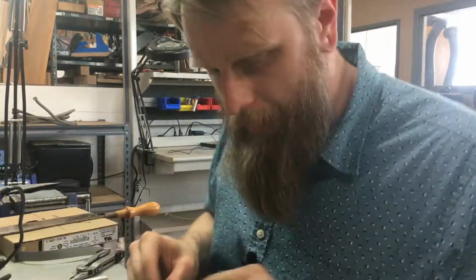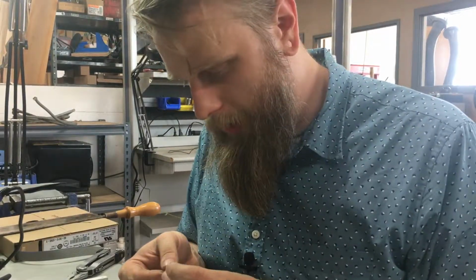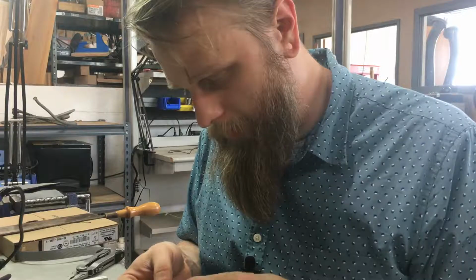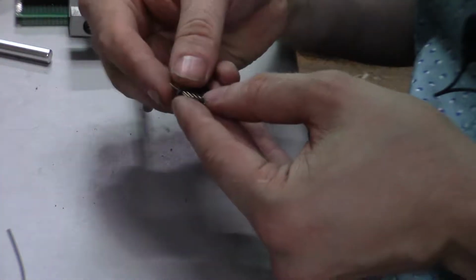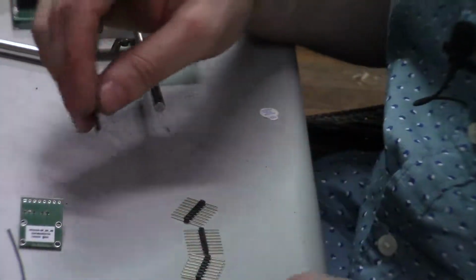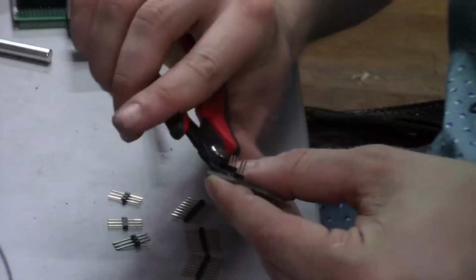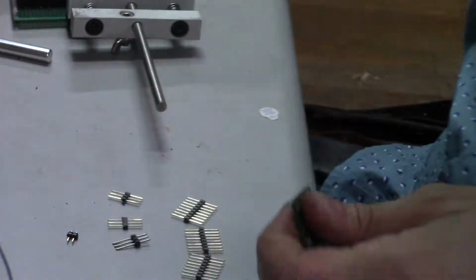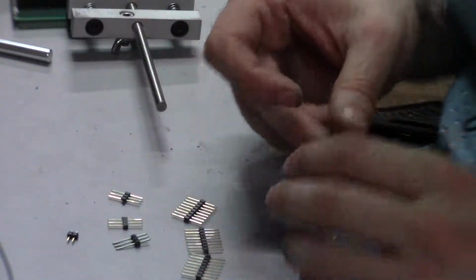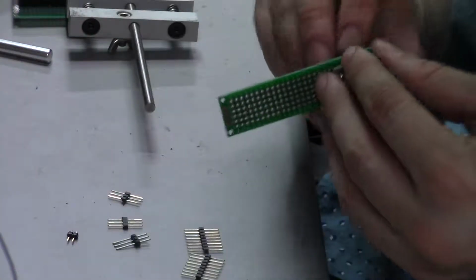So next up, we're going to make sure we have enough pins to do the headers and connectors on the other side. So it's a set of 8 pins. We need 3 of those. And then a set of 3 pins for a servo. 1, 2, 3. I also want to pull off these headers, because that side is the side that's bolted down onto a nice flat surface. So we don't want those headers. Okay, I'm going to want a connector over here.